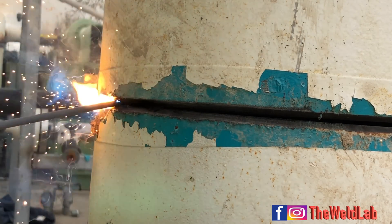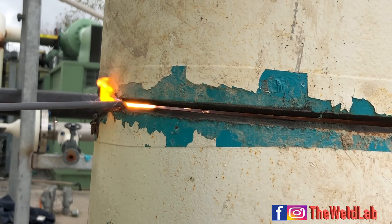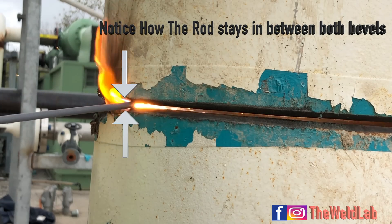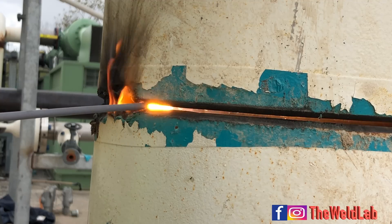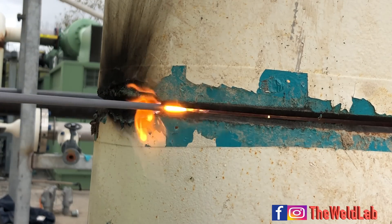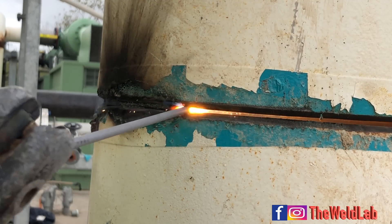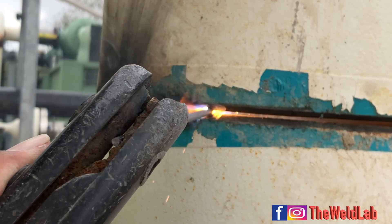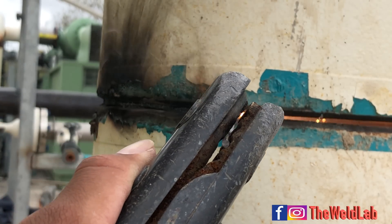Here I've got a 2G 12-inch. I'm currently running at 85 amps with a 3/32 gap. A 2G weld is usually one of the easiest with 6010 because the pipe can take more heat. If you keyhole, just whip out and whip it back in and you'll be fine. Keep doing that through the whole pipe. All you have to do is smash that rod in there, drag it, push it, and go down. Make sure the rod stays right in between both bevels so the root doesn't hang.